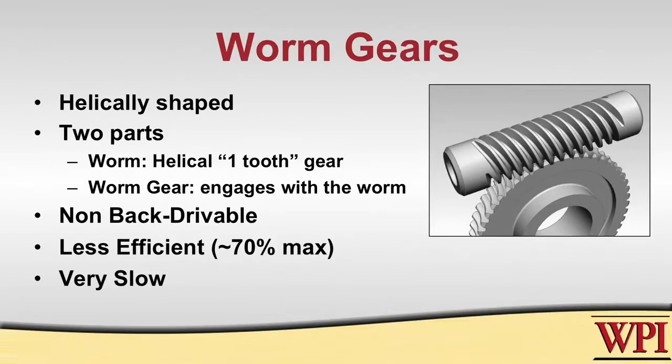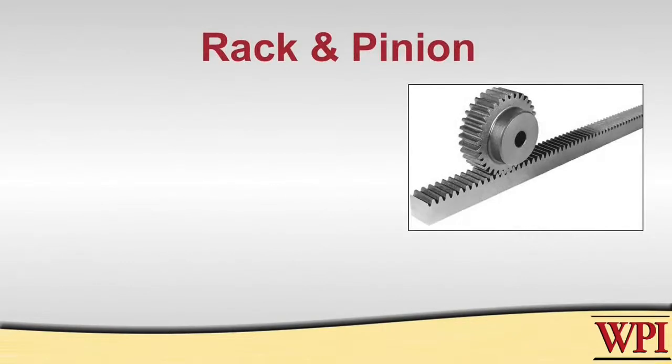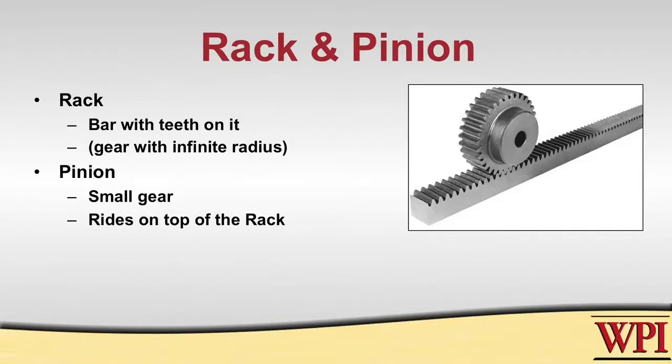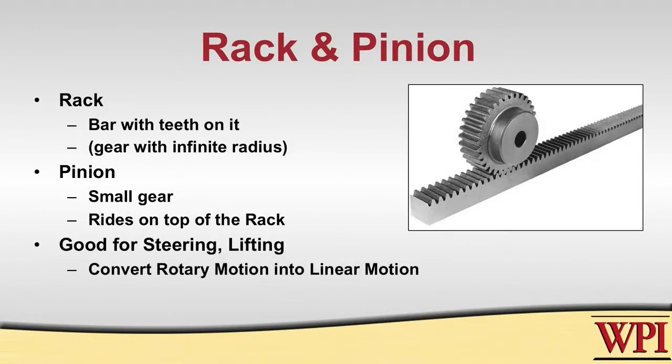The other kind of gear system is called a rack and pinion, made up of two components: a rack and a pinion. A rack is a gear — usually just a bar — with teeth perpendicular to the surface. The pinion is a small gear connected to the input that rides on top of the rack and controls the movement. The size of the pinion is important because it controls the rate of change of movement in the system. So whether you're steering, rotating, or lifting something, picking the right size is important for your design.